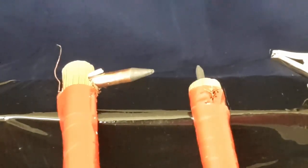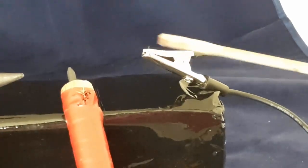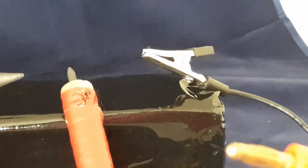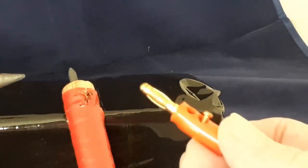You're going to need a grounding wire. This is an alligator clip — I've ground the teeth off that clip, which makes it easier to use on plates and on some components. The ends of all the wires are attached to banana plugs. In some cases I just solder the plug to the wire and then cover it with shrink tube, rather than bothering with the plastic tip which can be wobbly and a pain in the neck.